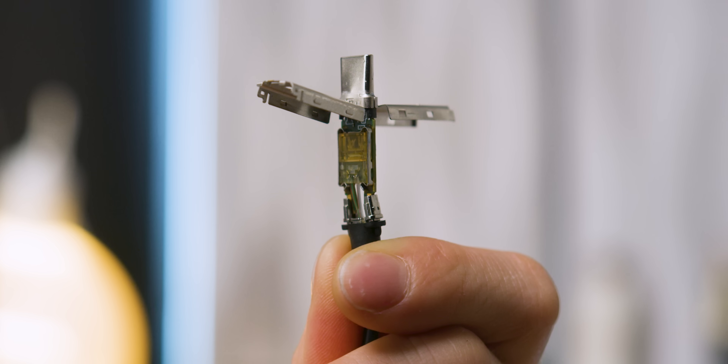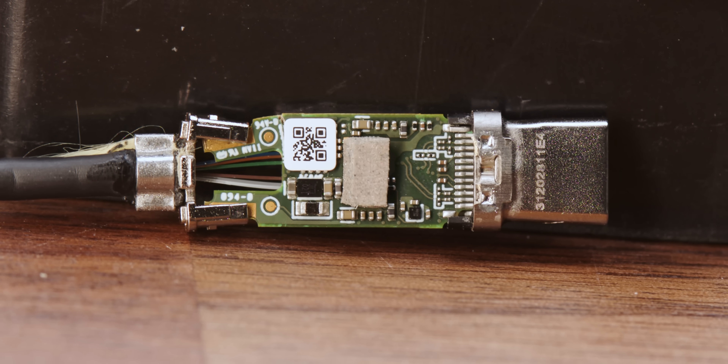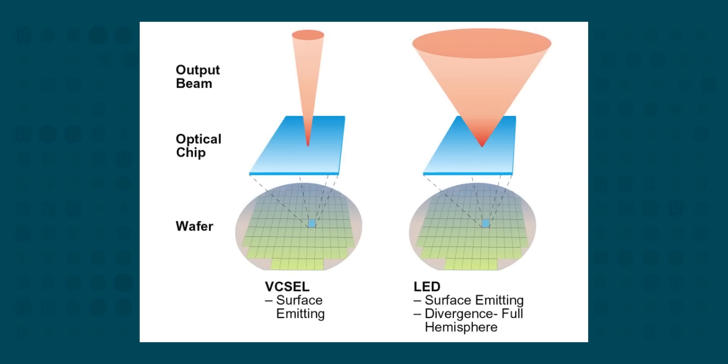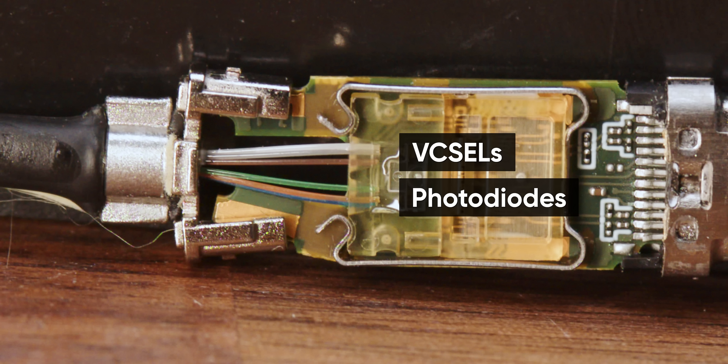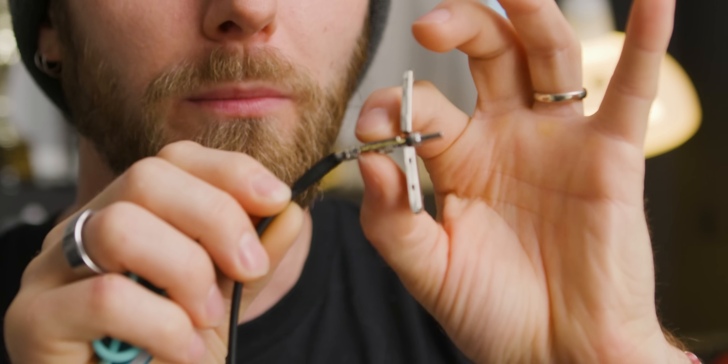We cut apart a $400 cable to show you this. Packed inside each of the connector ends is a tiny little circuit board containing the components that take an electrical signal, convert it to an optical signal, transmit it over each fiber, and then convert it again at the other end. Each connector contains three VCSELs — vertical cavity surface emitting lasers — a type of light source common in fiber optic networking because its narrow beam and fast switching speed offers superior performance and range compared to LEDs, but at a lower cost than full fat laser emitters. There are also three photodiodes which are the detectors that receive these laser signals, along with chips to control the laser timings and turn them back into electrical ones. Corning has put a lot of work into designing the strain relief that protects the optical fibers and bonds the circuit board to the cable.